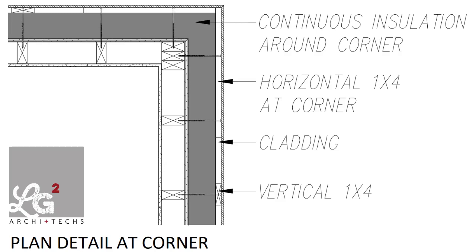When you get to the corners of a house that has exterior insulation, when you reach that corner there's four inches where you cannot attach anything. Your vertical furring strips, when they get to the corner, there's nothing to attach to right at the corner of that insulation. That's why we have all these horizontal pieces at the corner, and then we put a short piece in between those horizontals — that's what we attach to. Those verticals are attached to the horizontals because the horizontals are tied back to the structure, and in each horizontal we have two screws for secure attachment.